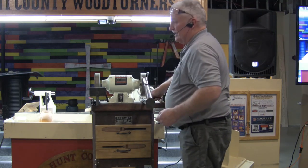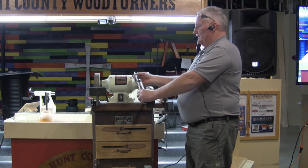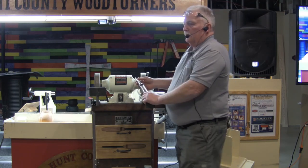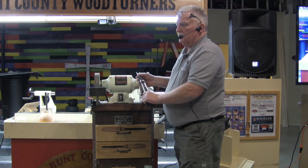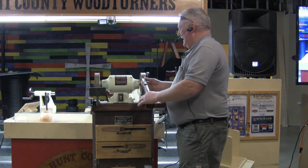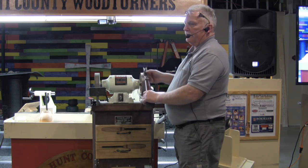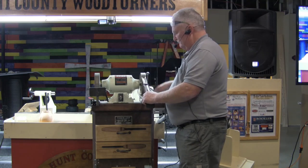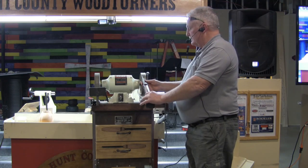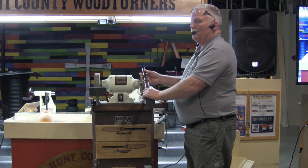Now, this is not like other fixtures that you have. Every time you sharpen this tool, you take a little bit of steel off of it and this thing falls further and further down, which makes the angle steeper and steeper. But all I'm going to do is with this sitting here, turn this on, and just touch it once. It's a 600-grit rock — one pass, we'll do it. One of the problems you have with this is you need to start on the side and go all the way to the other side and quit.